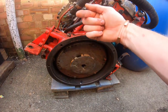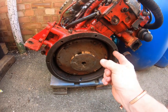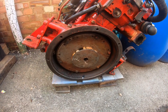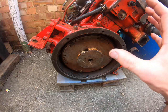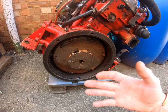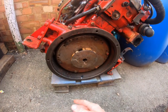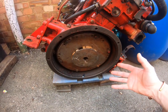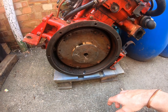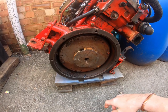From the front of the engine it always spins clockwise, so the back of the engine is always anti-clockwise. As the engine's firing a piston, the crank is spinning — the flywheel keeps the inertia of the engine and smooths that process down. Modern vehicles like my Transit Custom have a dual mass flywheel — a solid mass bolted to the crank and a secondary floating flywheel inside, so when you're changing gear or declutching you're still getting mass and spin. The downside to dual mass flywheels is they can be horrible when they go wrong. Personally I think a solid mass is better.